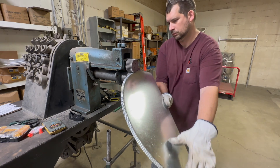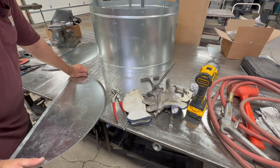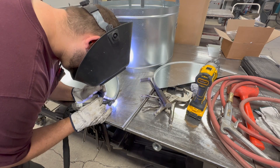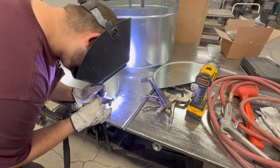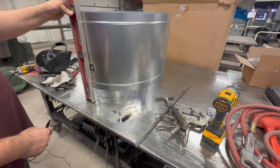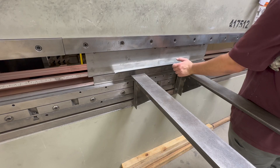I got those notched at the ends earlier, and now I'm flattening the blades up a little, making sure they're flat, then getting these corners welded. In this design I made the pivot rods go on top. If they went underneath, that would create an area where water could possibly go around the rod. So the rods being on top gives it a more watertight design.